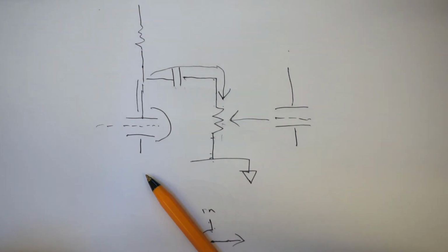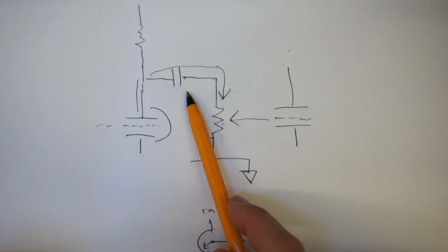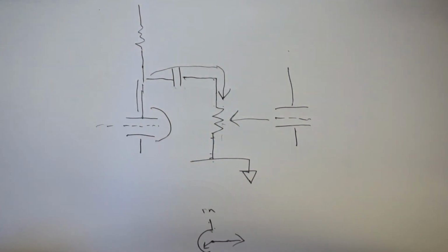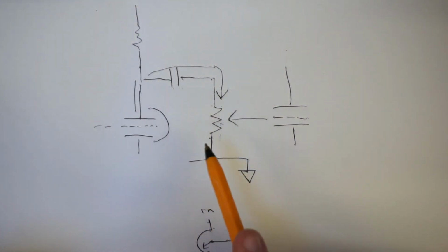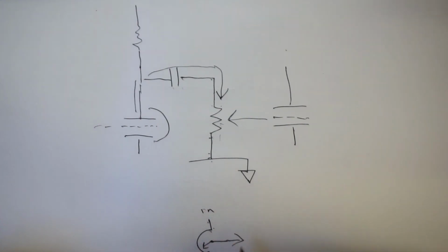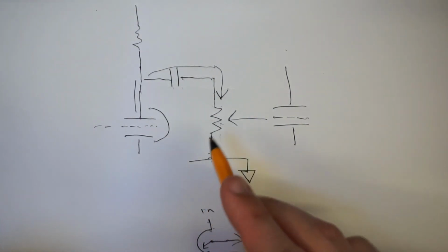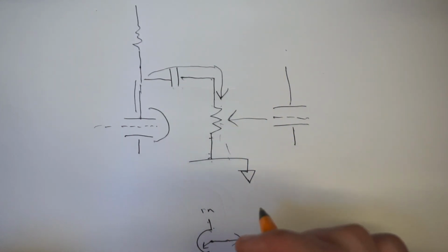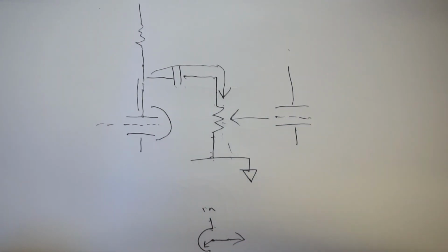I still want to experiment with capacitor values anyway. I should have really done the calculations before making this video, but I think off the top of my head, the cutoff frequency is still actually set at something like 160 Hz on that capacitor. So it still might be a little bit fun to play with, but ultimately I'm a little bit more confident that we can move forward and then kind of worry about these things later in the tone stack perhaps. Lots of things to play with. It is the first amplifier, so this is going to be something that we maybe learn about and improve over time. But it was certainly sounding acceptable, so we'll move on to the next task and leave it at that for now. So hopefully that's cleared a few things up for people.